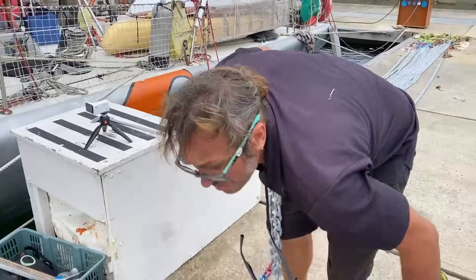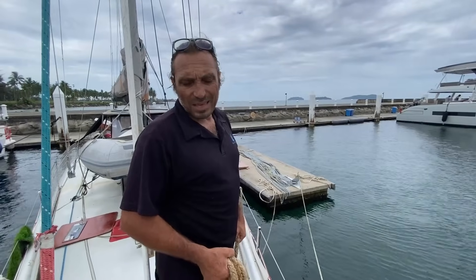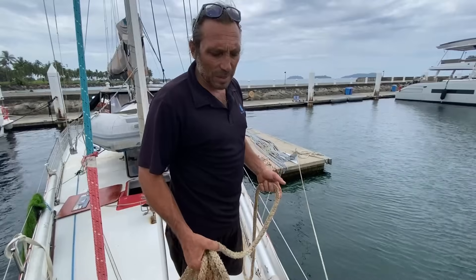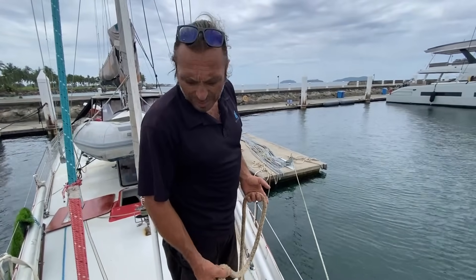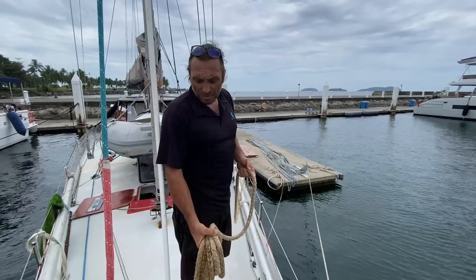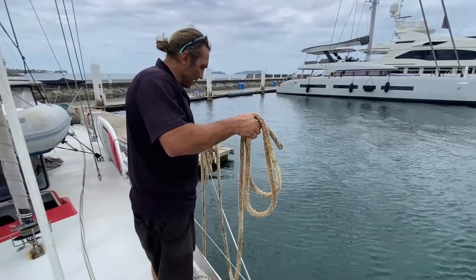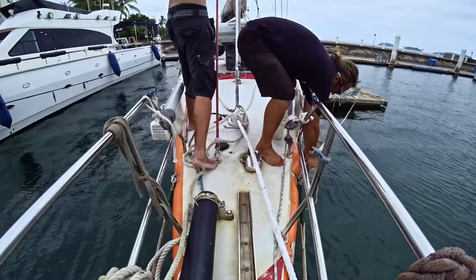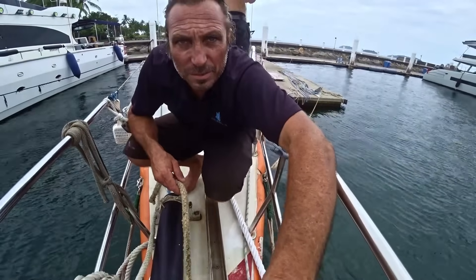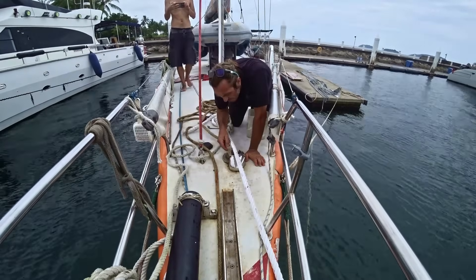We go back on board. This is a racing boat and doesn't have a cleat. If you see plenty of rope attached everywhere, we attach to the most structural point we have, like the chain plate of the staysail. Now the anchor line has to be free from everything. Here we go — under water, below this one, below this one again. From the bowsprit anchor, we go straight on the rail here inside to the chain locker.